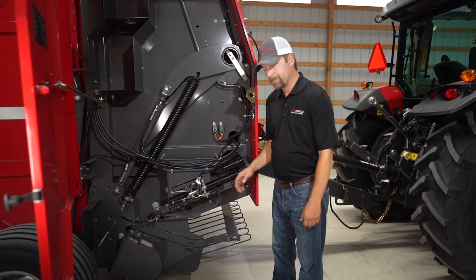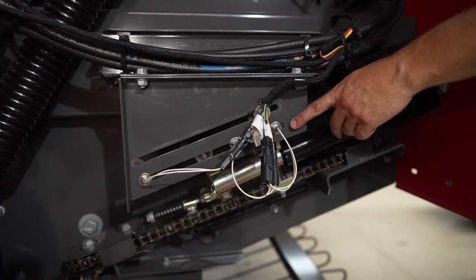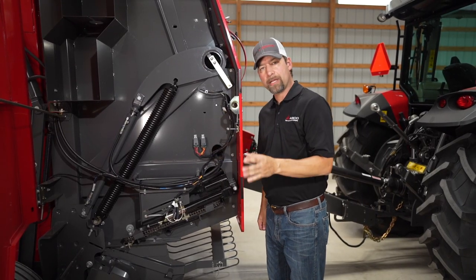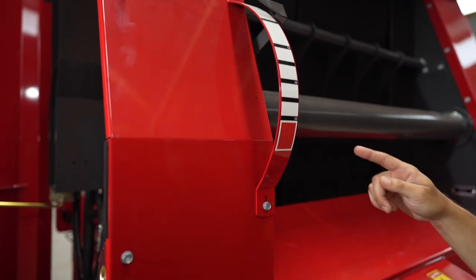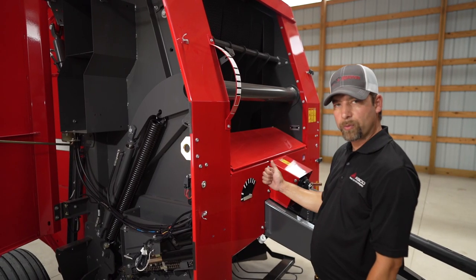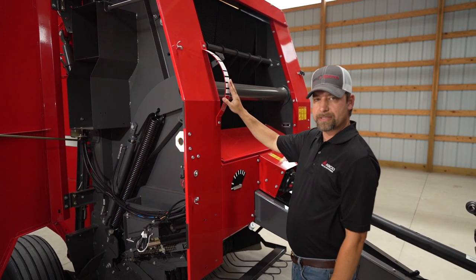To adjust your twine arm you can easily move these sensors to adjust your maximum left and right twine arm sensitivity. Also you see this sensor here — you can move this to set your maximum bale size, and that's when it auto ties. If you're ever in manual mode, there are gauges on the outside that you can visually see where your twine arm is, so as you're putting twine on manually this will move back and forth with your remote, and your bale size as it grows gets up to five feet — so this is a 1745D.